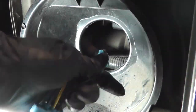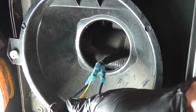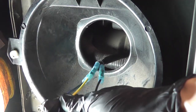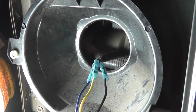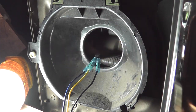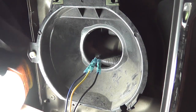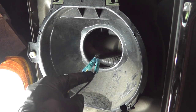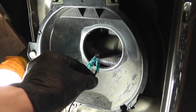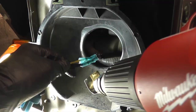And that's it. All that's left is to heat up the heat shrink with a heat gun to make these connections weather tight. I'm going to use a heat gun with this C-shaped nozzle, and I'm going to heat up this heat shrink until it shrinks to the wires and until the sealant — which is what makes these connectors weather tight — oozes out the ends all the way around. If your heat gun has two settings, set it on the lowest setting.